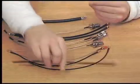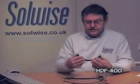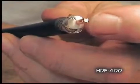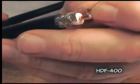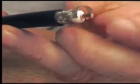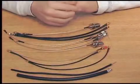If you want something a bit lower loss, which for longer runs you'd probably use, something like HDF 400, which is this one. It's quite difficult to bend any tighter than a radius of perhaps 4 inches. Solid aluminium inner, which was coated in copper, so you can solder it if you need to. It consists of a PTFE insulator, a wire braid, and an aluminium foil screen. This one's about 0.2 dB per meter loss at 2.4 gig, a bit more at 5 gig.